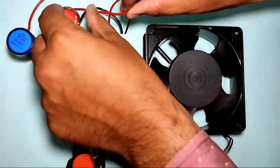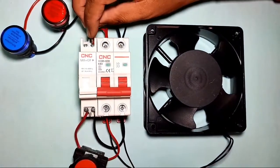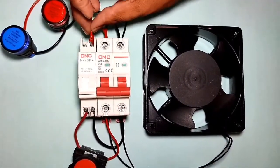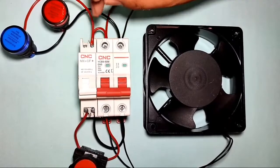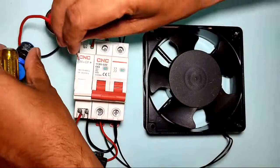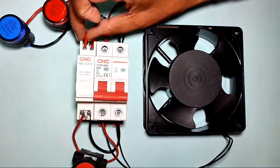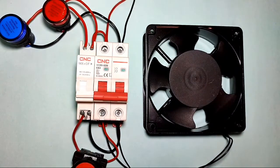For the phase control wiring, connect one wire to the MCB and to the common terminal, which is terminal 11. For the start indicator, connect terminal 14 — when the MCB starts, the start indicator will blink. For the stop indicator, connect a phase wire to terminal 12.